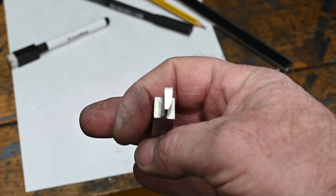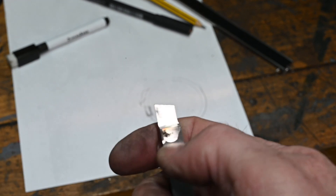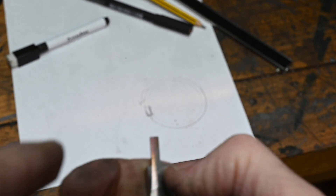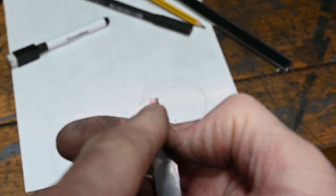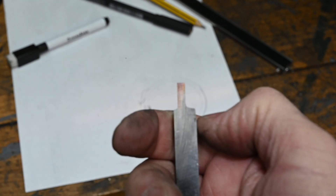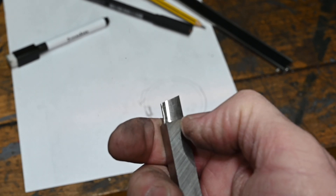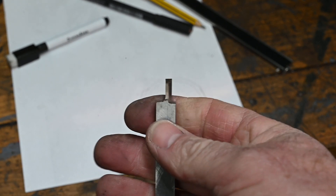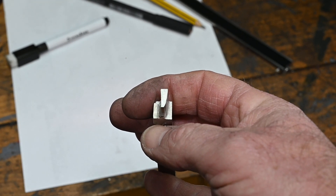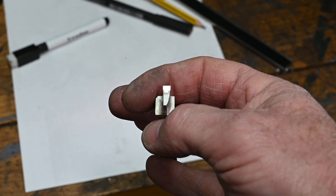There you can see the little round that I've put on it — that's going to follow the radius of the circle. I've also put a bit of relief on this side and it tapers back slightly from the tip to the back. That's the trepanning tool — if you think of it as a parting tool but with a little bit of a curve on it, a parting tool with a curve on it is basically what it is.